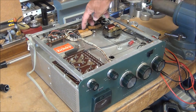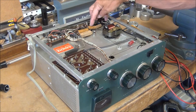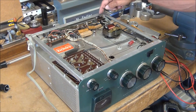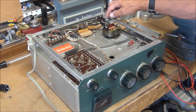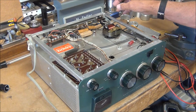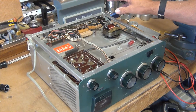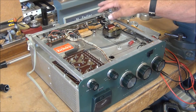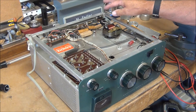One of the first things I'm going to do is replace these two old capacitors — I have some modern electrolytics to replace them with. The second thing is probably this transmit-receive relay, which has contacts that are a little dirty. You can burnish them with some success sometimes, but I would only recommend burnishing them with regular paper — not sandpaper, not emery paper, just paper.